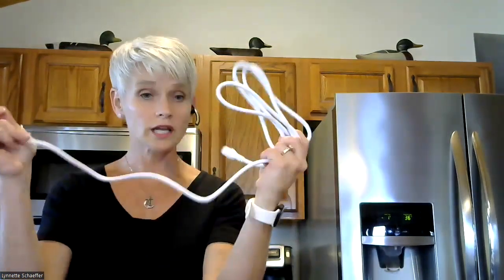The most important thing to remember is that you have to either buy the junction box for it to operate properly, or buy the plug-in cord. The junction box is a small white box that allows you to either hardwire with a switch or hardwire without. My favorite option is to just buy the cord — that way you don't need a junction box — though in cove applications the junction box might be a better fit. Either way, the cord plugs into one of the ends making it really easy to install. The junction box options are: one with an on/off switch, or one without, and both are hardwired.